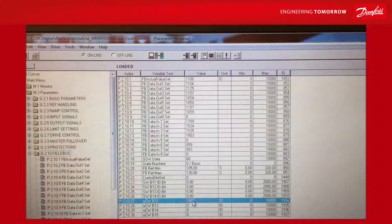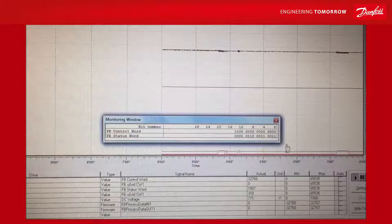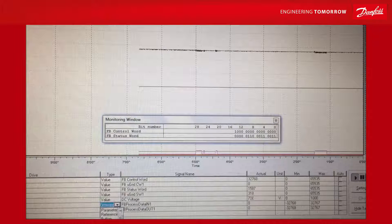For commissioning purposes, it's useful to see what's going on inside the drive. In NCdrive, open the monitoring page and select to look at the field bus control word — control word one for the ugrid — and also the status word, which is the bitwise information sent from the drive to the PLC. Also select some process values to make sure you have live values, and look at what is being sent on the field bus to the PLC so you can compare with the PLC programmer. In the field bus process data input view, select the firmware here.